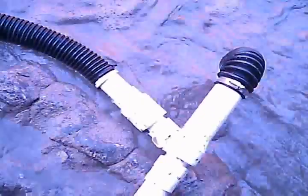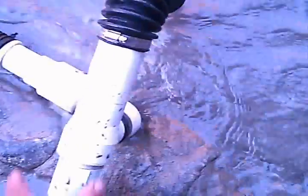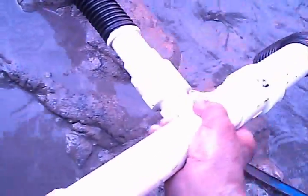Today I'll be using the model 625 HDP hand dredge from Golden Super Products. You can tell this is the hand dredge because the discharge valve follows the 90-degree elbow. Also today I'll be using the 12-inch telescoping pipe assembly, the inch-and-a-half steel-lined restrictor nozzle, 2-inch diameter discharge hose, and the experimental gravity trap concentrator.